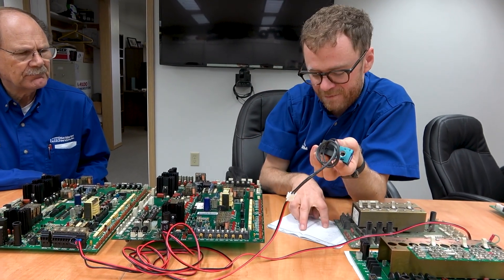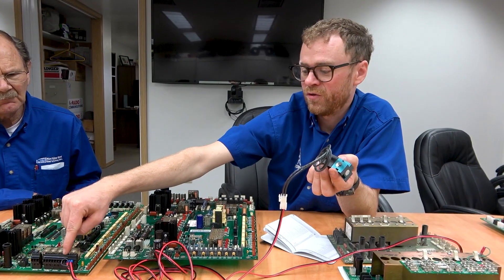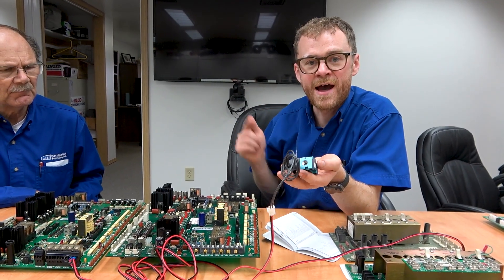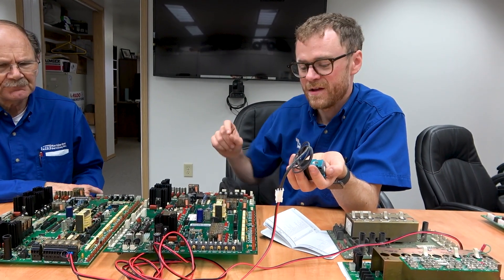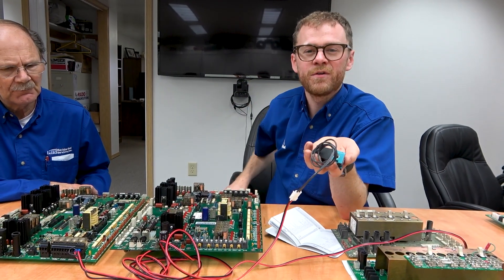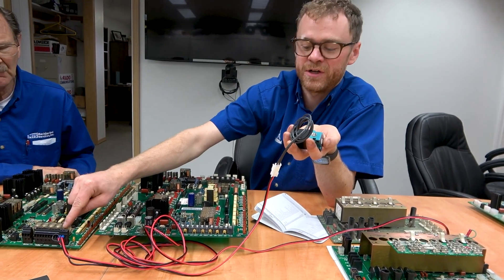When you run M51 this is going to turn on, and when you run M61 this is going to turn off. You could move it to M52, M53, or M54. This would be a simple way to add an air blow or an external pump. This relay is what they call a dry contact — we've got common, normally open, and normally closed. Depending on whether you're running a robot or something else, you may want normally closed versus normally open, but there's no voltage here — none.